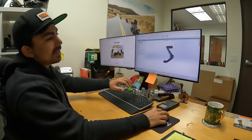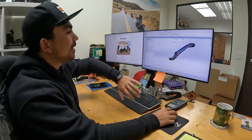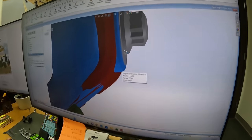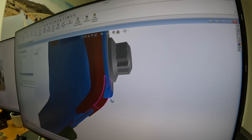You make it look easy, but they don't see the years it took. My first one was under-rotated, my second one I landed, my third one I over-rotated, and then there were probably 10 more crashes after that, which I showed you guys two vlogs ago. So we're going to use the 3D scan as a reference point. We were having some scraping issues on the washer here, so we're keeping that into consideration. The blue is the stock one, and it had the washer which hung out even more — the washer was larger diameter than the piece itself — so we cleared up all that area to make sure we're not going to scrape there.